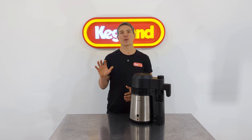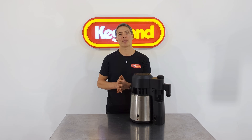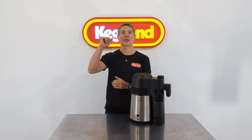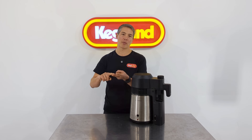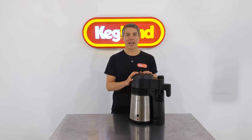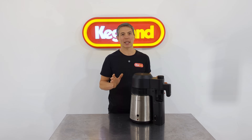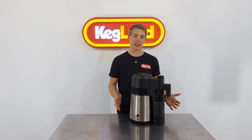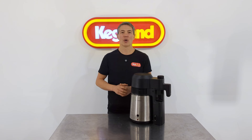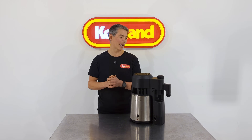Normally for most of our other large format stills like the Polyphoenix or the Alco Engine, or even some of the other ones on the website, you would have to get water coolant running through the head of the still — whether it's a pot still or some type of reflux still. But with air stills, you simply plug them in and they use air to cool down the product, making them really easy to set up, neat and easy to store. You don't have hoses running all over the place, extra taps or water tanks that you have to recirculate from with water pumps.